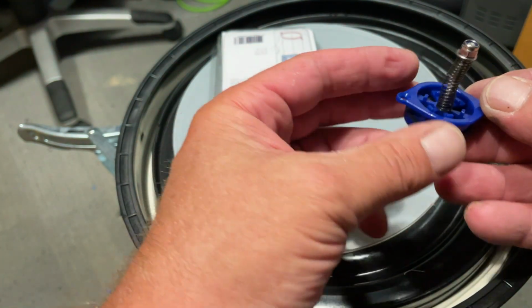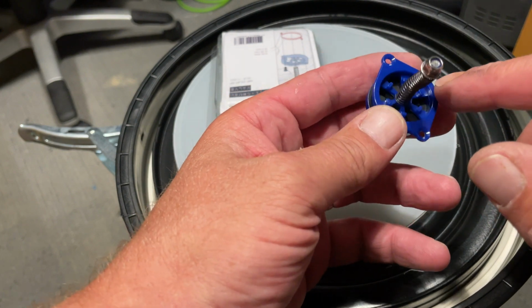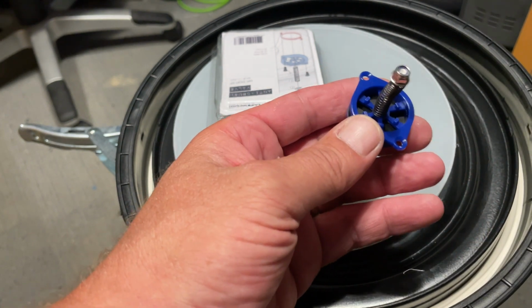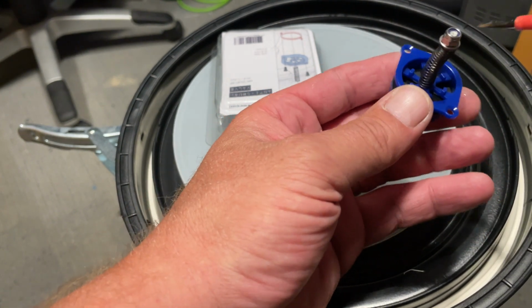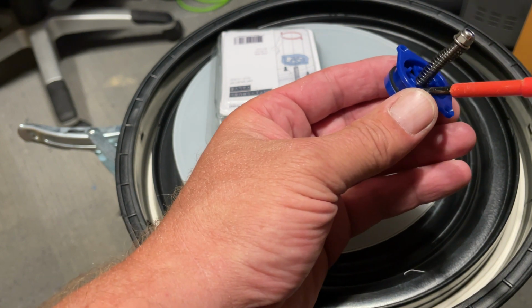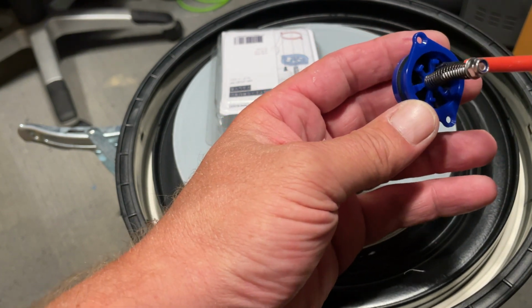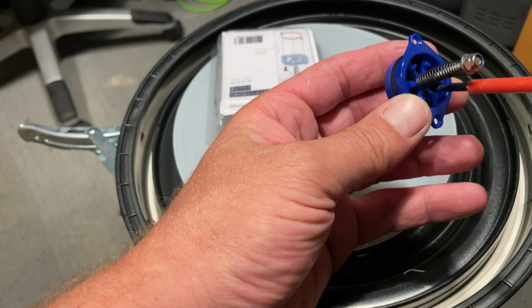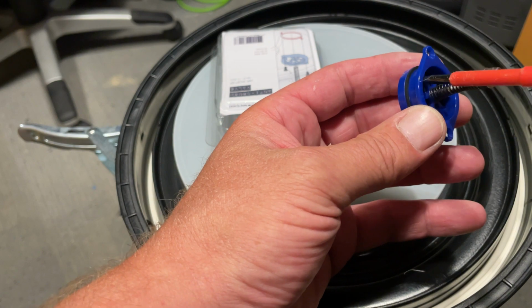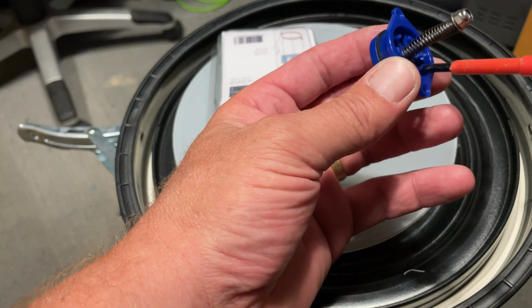So there you go. What I did do is I have a box with a selection of O-rings, and when fitting it I did apply an O-ring to the outside edge there, going around. I did fit an O-ring inside that little groove there, and then drilled with a Bosch hole saw a diameter that big, which means that O-ring, when it sat up against the Perspex, did actually form a seal of its own.